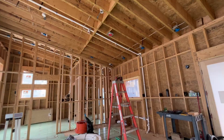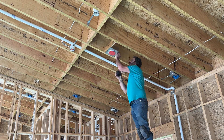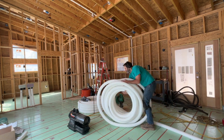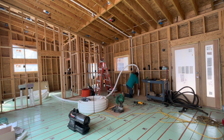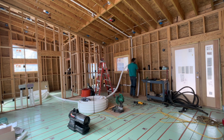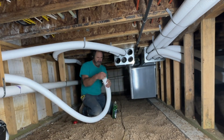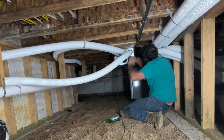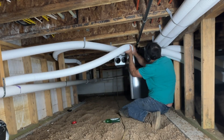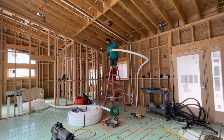There you can see the red register — that's the register hooking up to the pipes that go down below to the unit. It's good to roll this pipe out. The only way this works really well is if you roll a big chunk out, then cap the ends before you shove it down through so nothing gets inside the pipe. Then go down below and route it how you want, put a gasket on it, and hook it up. Once you get comfortable with how the whole system works and get the pipes up where you want, you can estimate the size and route the pipe up to the ceiling.